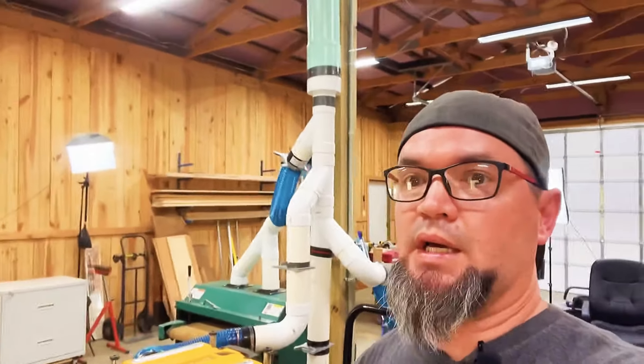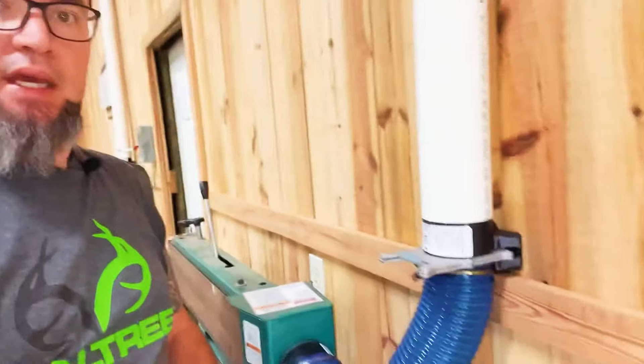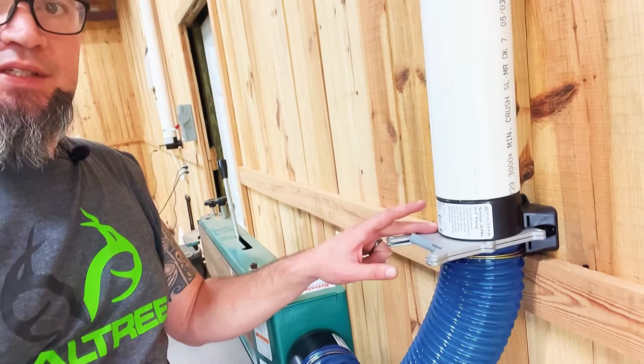There are a lot of different things you can use for dust collection. You can run everything in dust collection pipe. I chose to use PVC — it's easy to work with, very smooth insides, and you can find all the different angles and types of adapters. But the problem is retrofitting PVC to fit dust collection. If you watched my last video on must-haves for running a PVC dust collection system, trust me, the adapters I had you pick up are lifesavers. These Rockler PVC-to-dust-collection adapters — I have them everywhere. Any place I use a blast gate, you're going to see one of these. It made it so much easier to hook up.